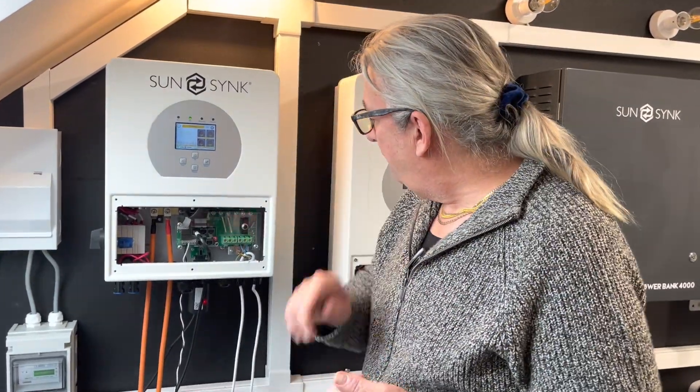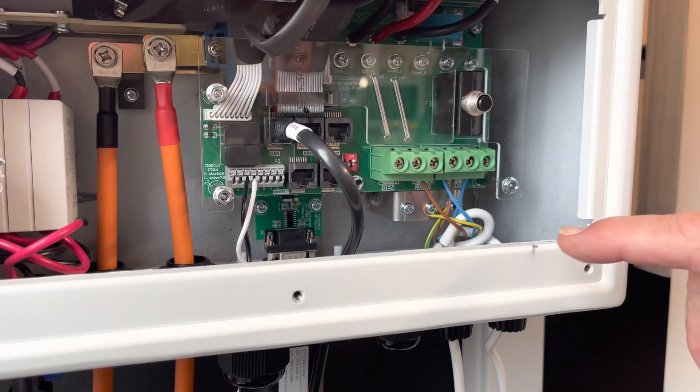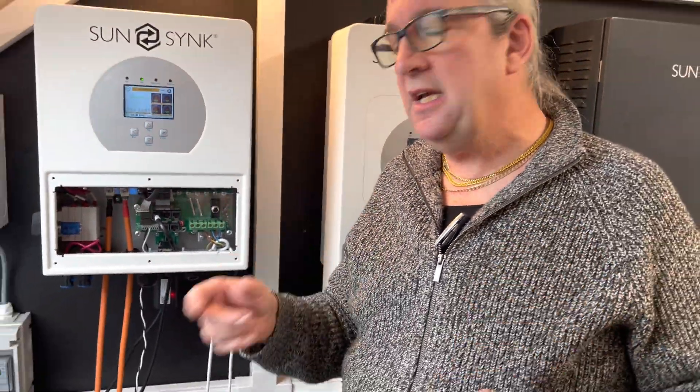It's really small and compact — it can go anywhere. You can see on here it's got six connections: three pairs plus the earth underneath. The first is a generator input, the middle is the load which is your essential, and the end one is the grid — normally both in and out. For most AC-coupled applications, all you do is connect the grid connection to your fuse board. Put a suitable isolator and protection device — the grid goes directly to a fuse, probably a 30-amp fuse or less on your consumer unit. Also put in an RCD and a rotary isolator.